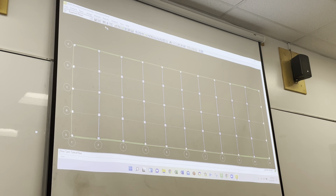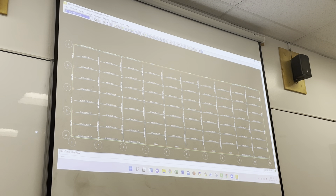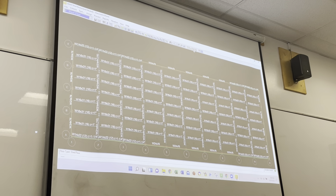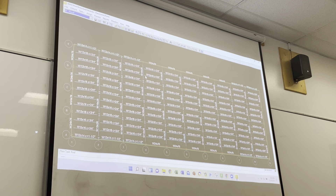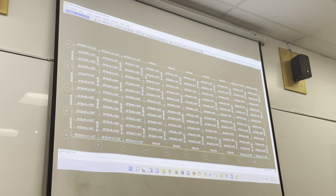Last time we looked at the steel floor and this button here shows a few sizes. We can increase the size. This is what we saw last time - W16x31s on the floors, W21x44 girders. Let's see what the roof looks like. Notice we've got studs called out on the floor girders. On the roof, there's no stud callout, but we've got W12x16 joists now, and W16x26 girders. Three-quarters inch camber - that's not too bad. There's no camber on the girders.